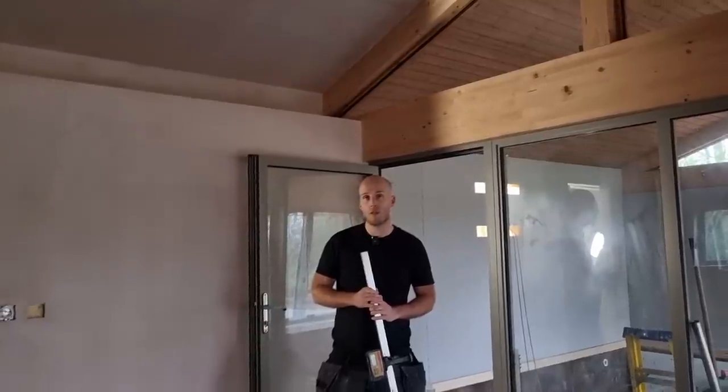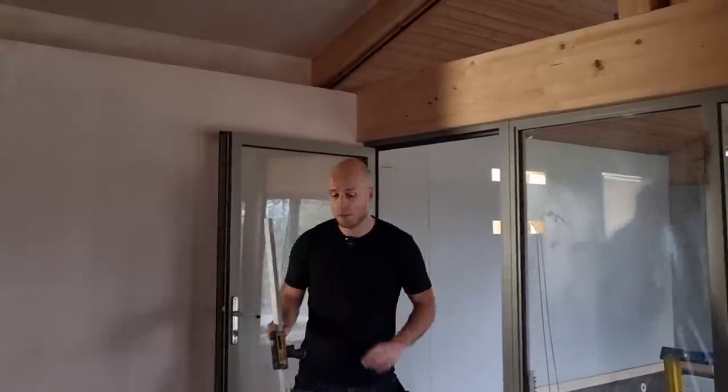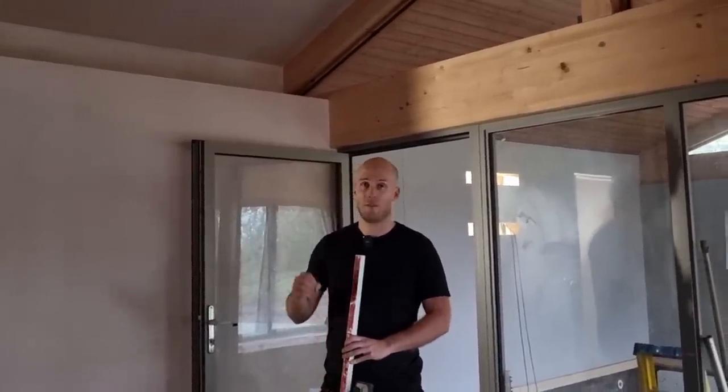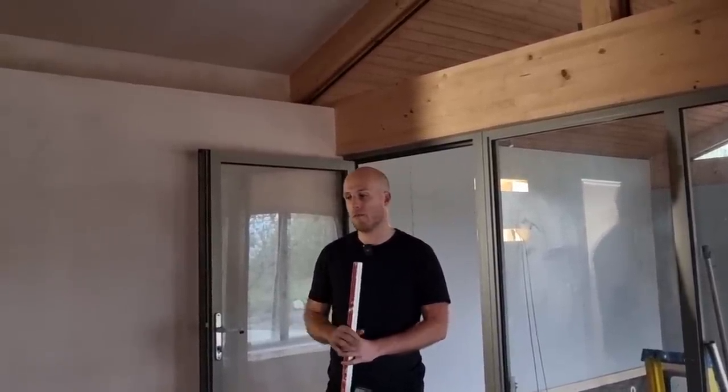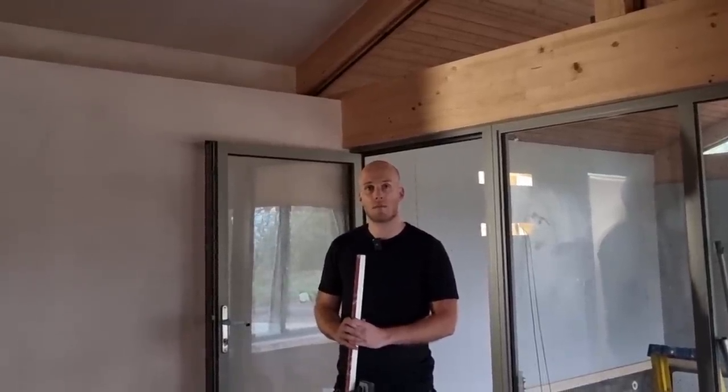And the product that I'm using here, tell us a little bit about the product. So that's a Rapide product. It's a gypsum Rapide. It's typically a faster drying screed. It has an additive that goes into it, pre-blended into the binder, that achieves slightly faster drying. So you're looking at 14 days maximum drying, and that's under ideal site conditions. But yeah, it just helps speed everything up. So is that 14 days before floor covering? That's right, before a floor covering, yes.